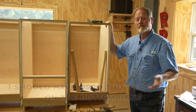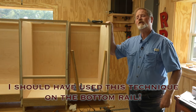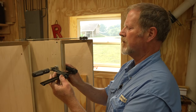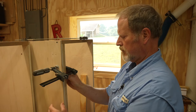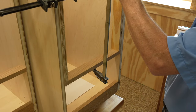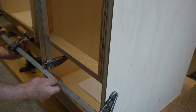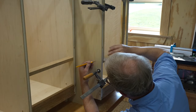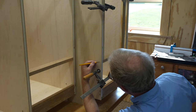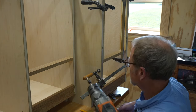It's very important these rails line up right. There's a technique for doing that that's really very effective. To index the rails, we're going to use spacer sticks, and we're going to index those against the top rail. We'll put the new rail in place and then use an F clamp to secure it. It may seem like belt and suspenders, but we'll go ahead and clamp it on the sides as well. You can probably eyeball this, and you might get it right, but you might get it wrong too. I usually choose to make my marks — that removes all doubt.